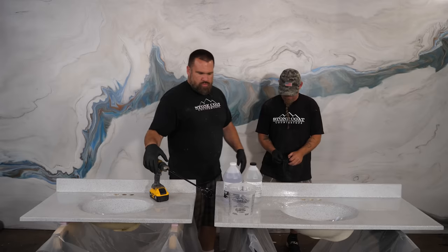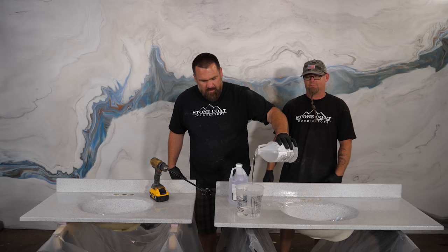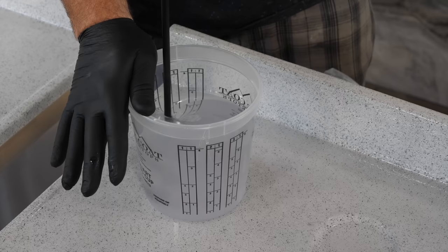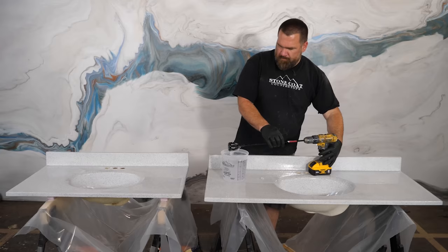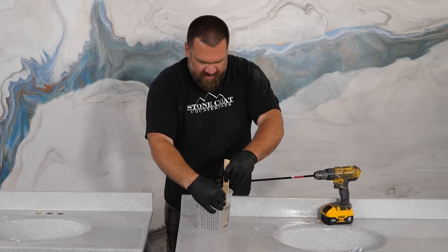Let's mix up. I always want to go with part B first — why? Because it is a little thinner, and you want to pour part A, which is a little thicker, second, so the big blob isn't sitting on the bottom. If you pour part A in first, it's not the end of the world — it'll still mix. Just be sure to fully mix. Midway through, use a paint stick and scrape the sides of the bucket really good to get any unmixed epoxy into your mixture.